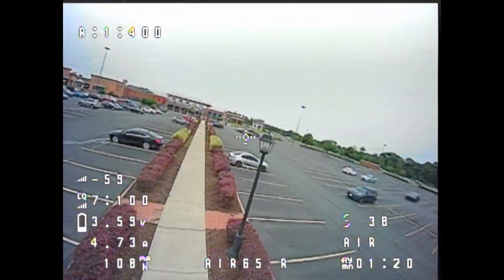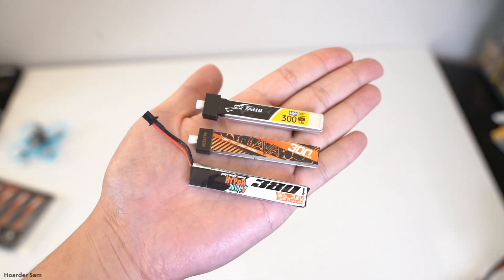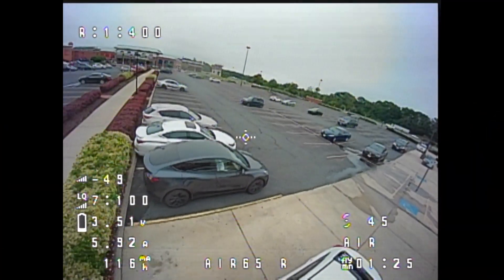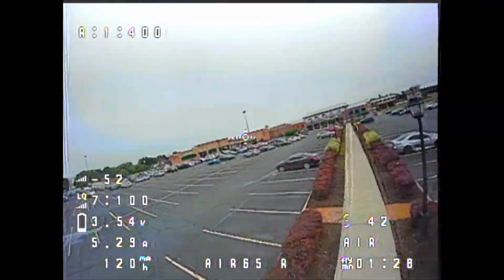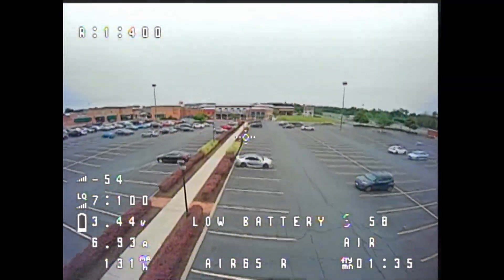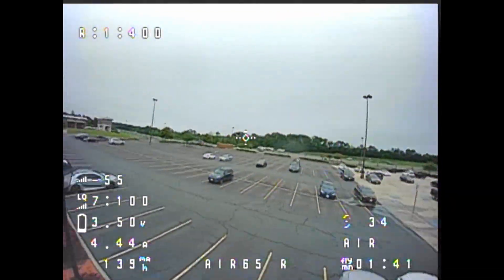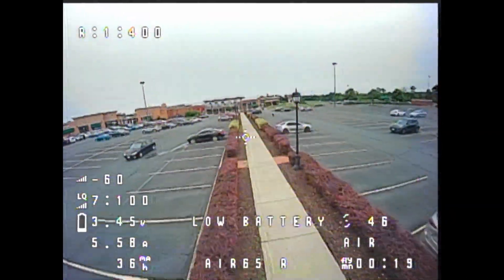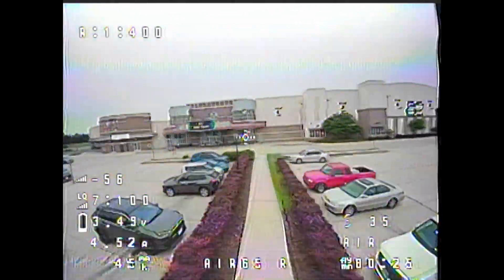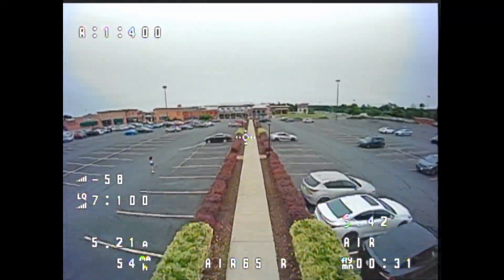In terms of batteries, this takes your standard 300 milliamp hour one cell high voltage battery. I tried three different brands: the BetaFPV Lava 300, Tattoo 300, and Pyrodrone 380. The Lava 300 and Tattoo 300 both performed really well and I couldn't tell a difference between them — each pack lasts about three minutes when flying down to about 3.5 volts per cell, which is pretty standard for this class. Most people buy a whole bunch of batteries and charge them all at the same time with a six-port multi-charger to keep flying non-stop. Surprisingly, the Pyrodrone 380 has the most capacity on paper, but I was only getting about one to two minutes of flight time with it — maybe a dud or an old battery. For now I'll stick to the Lava or Tattoo packs.